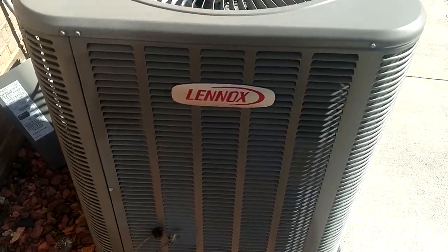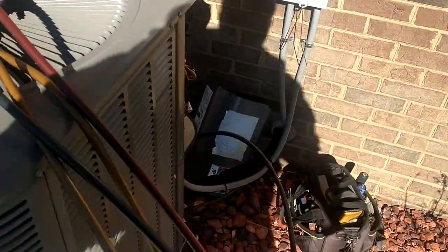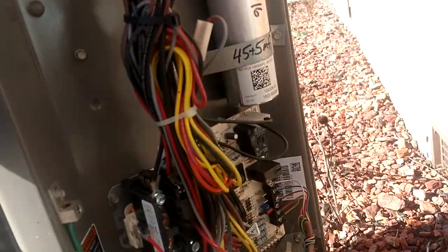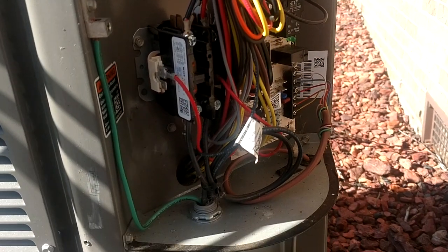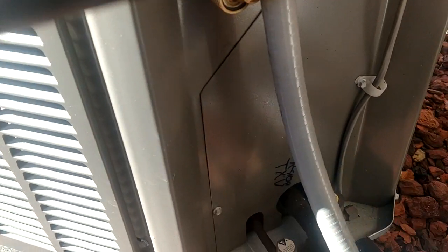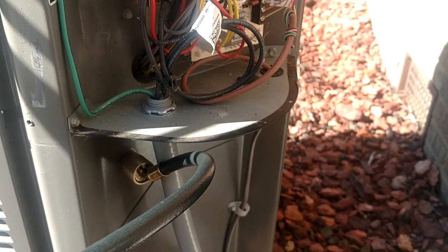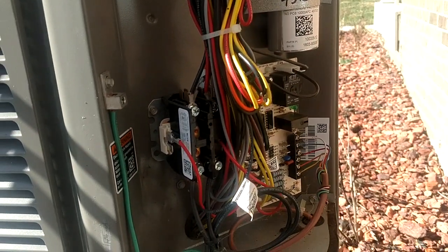About Lennox — they have been driving us crazy with their indoor coil leaks, the outdoor TXVs. I did a video the other day where I found a leak on the outdoor unit with my ultrasonic leak detector — I'll try to put a link to that in the description. They happen in the same place, down at the bottom on the TXVs. Lennox has just been killing us with leaks and we've actually steered away from Lennox, doing more Rheem and Bosch now.